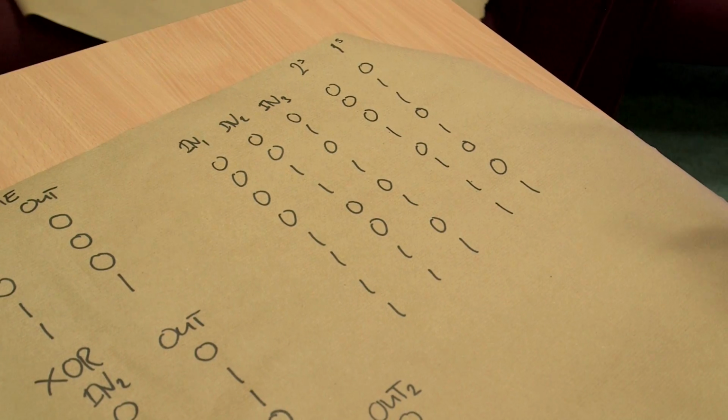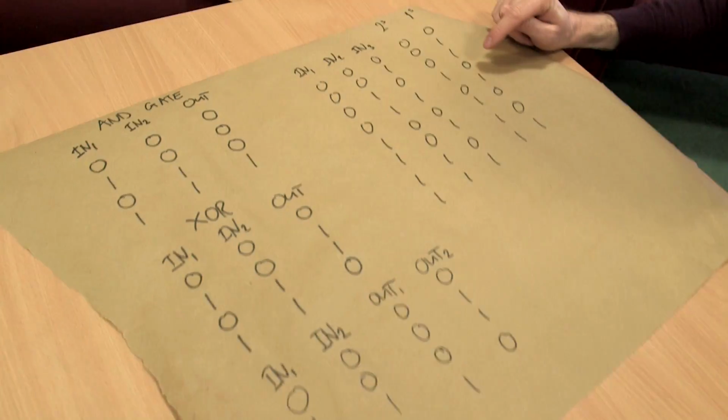So if we could build this circuit, we would have the full binary adder. And you can build this, right? All you need is basically to chain together 2 half adders, which is why that's called the half adder. With a little bit of careful positioning, you need a lot of dominoes at this point, maybe 2,000 or 3,000 dominoes to make this work reliably. You could make a massive circuit which does this. And once you can do that, you can then add any binary numbers together that you want.